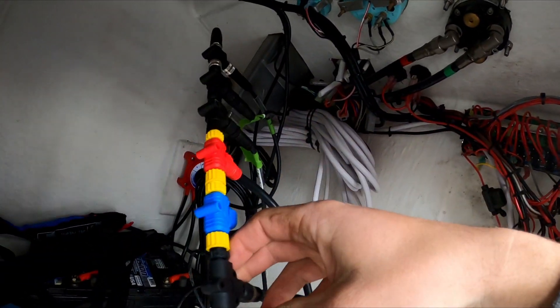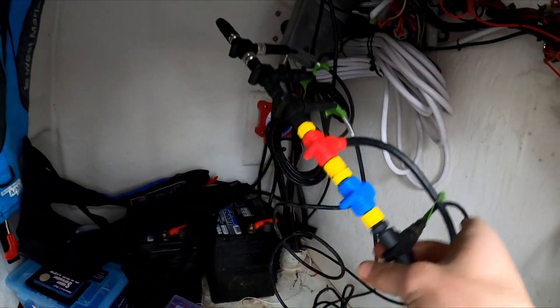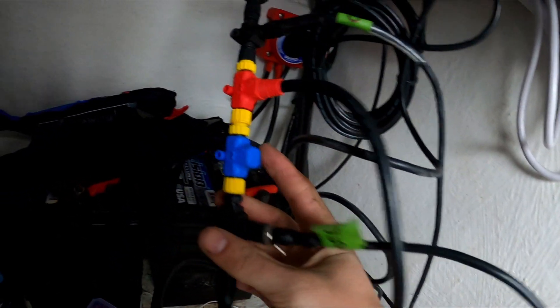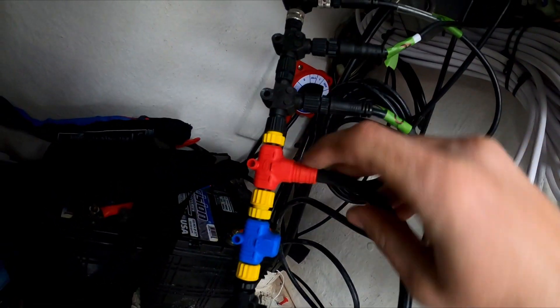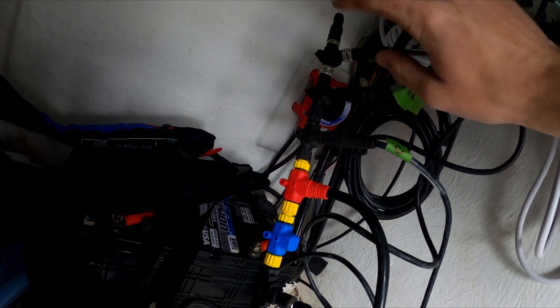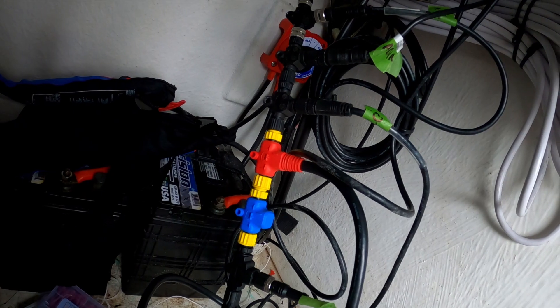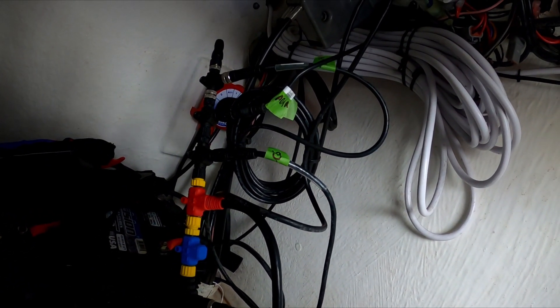All right, the back end is rigged up here — this is what it'll look like. I just need to figure out power on this little power block. I'll test it out before I fit it. I'll probably mount it right below the chartplotter. So we've got outboard here, power isolator — you need that so it doesn't back-feed into electronics — and you want your power in the middle from what I read. Then GPS, radar, and that goes to the unit with a terminator on each end. That should be how it works — if not I'll let you know, because I've never done this before.